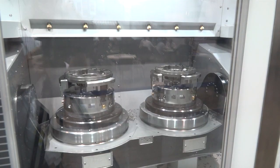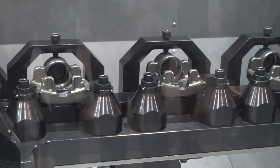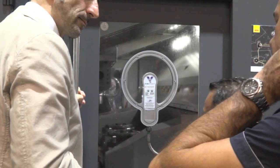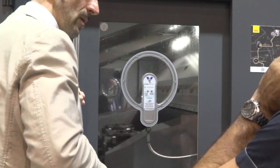Now when this turns in a minute we'll see, but on the other side you've got 5 axis, haven't you? Absolutely right — we have a 5 axis system on the other side, so we can incline within the 4th axis and position within the 5th axis. We can also have slight turning operations on that axis because we reach RPMs of about 1,200 to 1,800 RPM.